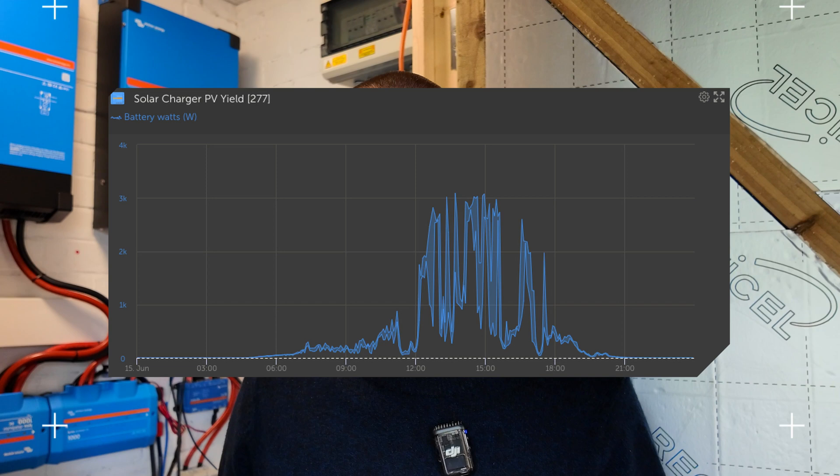Going into this I was under the impression that the 340 watts per panel is not something you're likely to actually see — it's a figure derived from testing under lab conditions used to compare one panel to the next, not a realistic representation of real-world output. I think in the sort of weather we're having — often cloudy, 15–17 degrees — when the sun does come out and blast the panels, those are probably ideal conditions: maximum sunlight onto panels that aren't particularly warm. I am seeing them produce well over three kilowatts; 3,100 watts is not unusual, and it's not the norm — usually it sits around 2,800–2,900 — but I am seeing it blast above that three-kilowatt range, which I'm quite impressed with. Whether that will continue into July and August, we'll see — it's England, probably not now that I've installed solar panels.